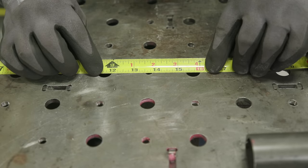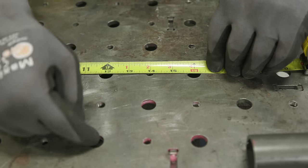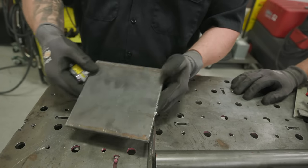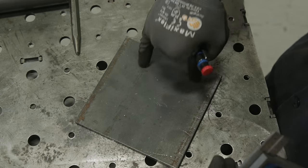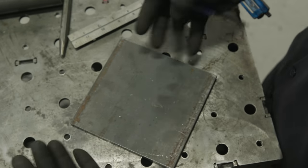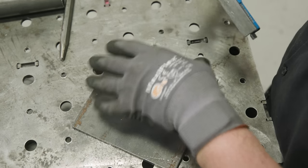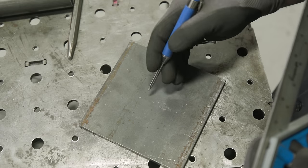If I measure inside to outside, same thing - I'm right at four inches. That tells me my center-to-center spacing. I do the same thing going the other way to make sure - these are also four inches on center. So my hole pattern is four inches by four inches. I'll transfer that to my base plate. The plate isn't 100% square, so to fix that I'm going to pull all dimensions from the center - I have enough material to do what I need. I'll find center of the plate, pull two inches up and score a line, two inches down, same thing for right and left.